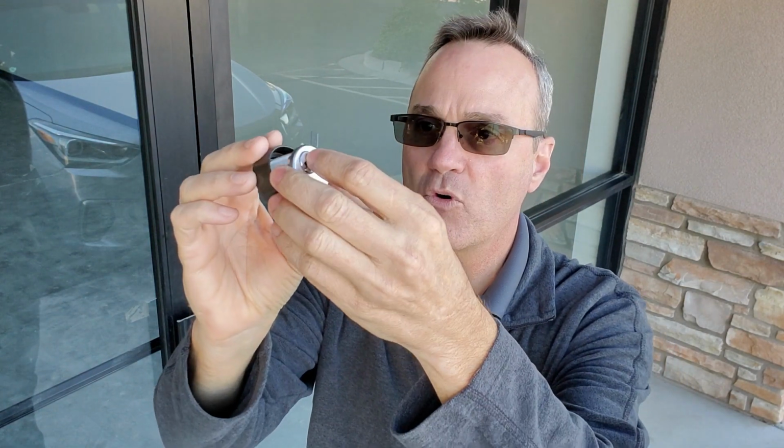When you install the mortise lock, you slide the torque collar on it like so before the installation. What this does is it creates a little shield that'll spin freely outside of that mortise lock. So you put a pair of vice grips on that, or you put a pair of channel locks on that, nobody's going to be able to grip it. It'll just slide right off. And that's how you protect a glass aluminum storefront door from being penetrated by basically a pair of pliers.